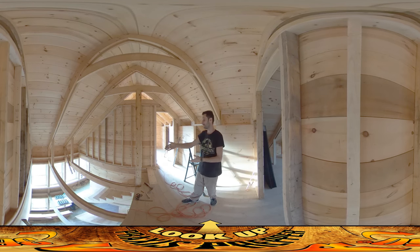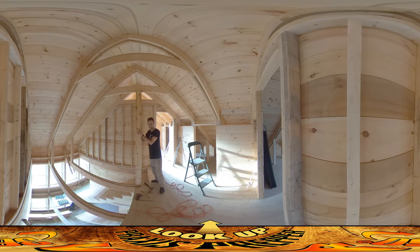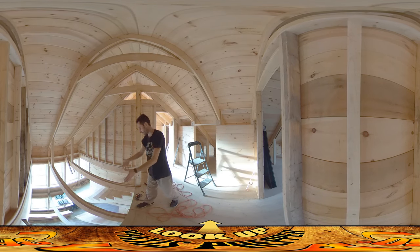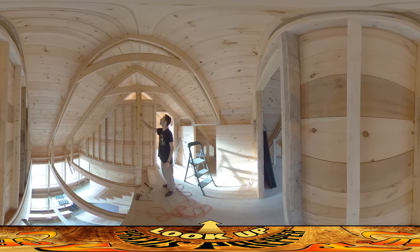So what I wanted to do today — and my dad's been helping me, he erected this whole thing — is put together the post that is actually going to be here, so that I can put a nailer across and have some kind of railing to prevent people from accidentally falling over the edge. These are two-by-sixes — incredibly gross overkill. I came up and just saw this thing and it's ridiculously strong. But the reason we use it is because it reflects the rest of the posts that go down through the structure. It bites into the collar tie up there and grabs it easily.